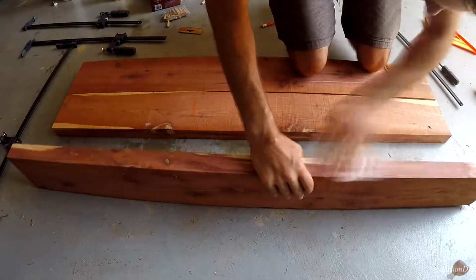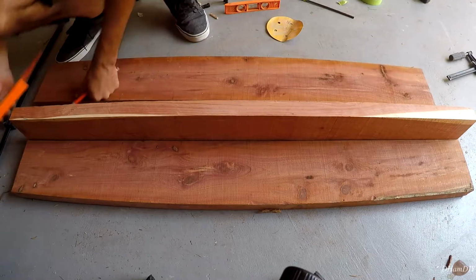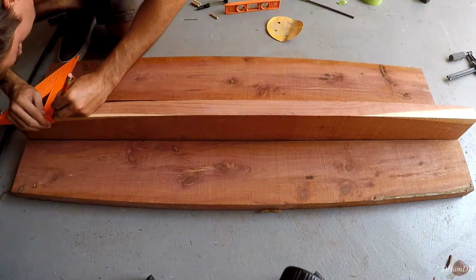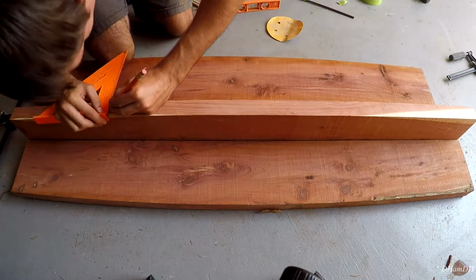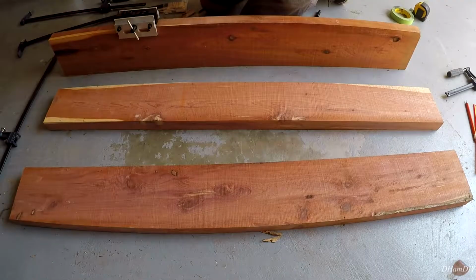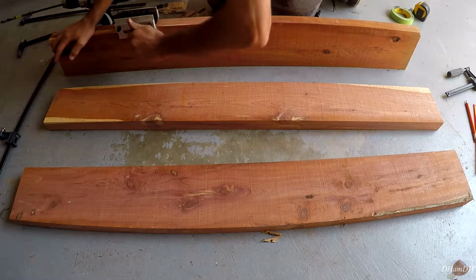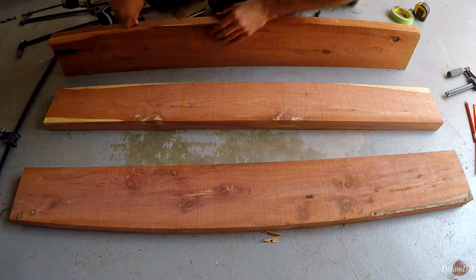It's comical at best. But like I said, I'm marking these dowels out, and I'm trying to be as precise as possible. I'm really taking my time here. And I bought a dowel joining kit as well, which, not good. It's really just a guide you put on top that you clamp down to, and you put the drill in, and drill it out. Well, it was wiggling during the process, so even a fraction of a degree is going to make these dowels not work right.